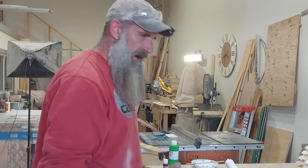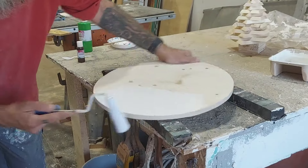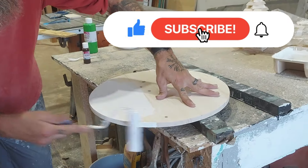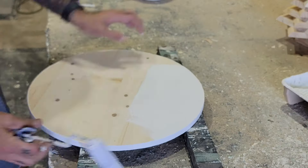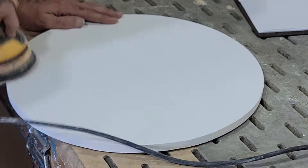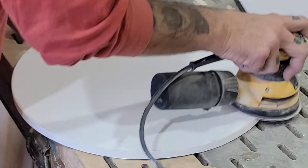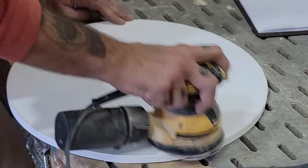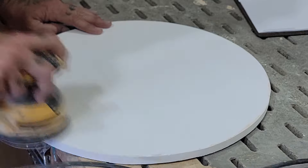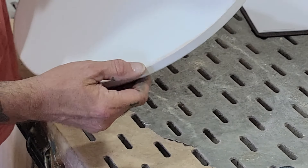We're going to put a couple coats of white on the door hanging, just using white latex, and then we'll do a little bit of distress on it, and Cheryl will put the lettering on. We're going to distress the door hanger — just around the edge, going to burn through the paint so where the wood shows through. Start out light, and if that's not enough distress, do it heavier. If you go heavy right off the bat, you might mess it up and have to repaint. So it's best to start off lightly and gauge as you go.